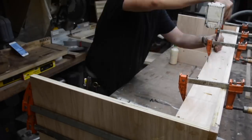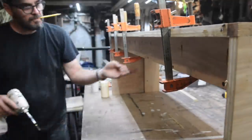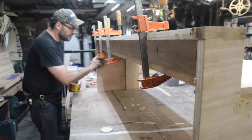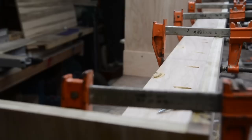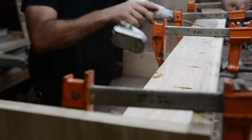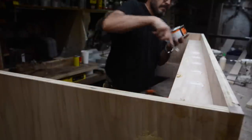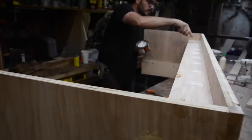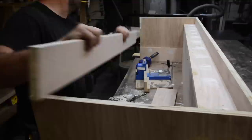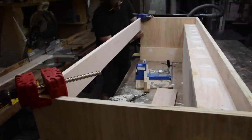When I put all these screws in place I do cover them back up. I'm using straight screws just for that lap joint, and I'm using plastic wood to fill in those screw holes. You can see all those Kreg jig holes. I use ready patch in some cases when there are big spots to fill — there's really no reason why I use one over the other. The ready patch just seems to be cheaper because it's a little more plentiful. I'm using my corner clamps to hold that in place while I screw it.